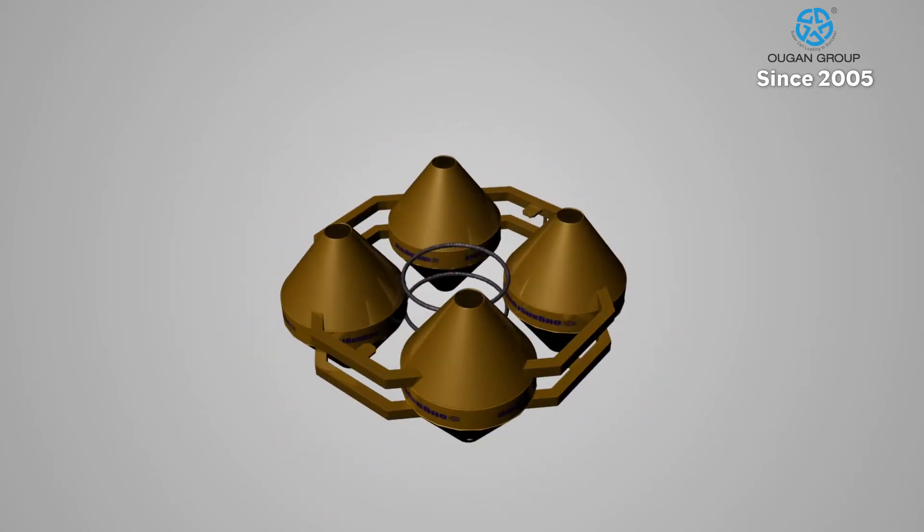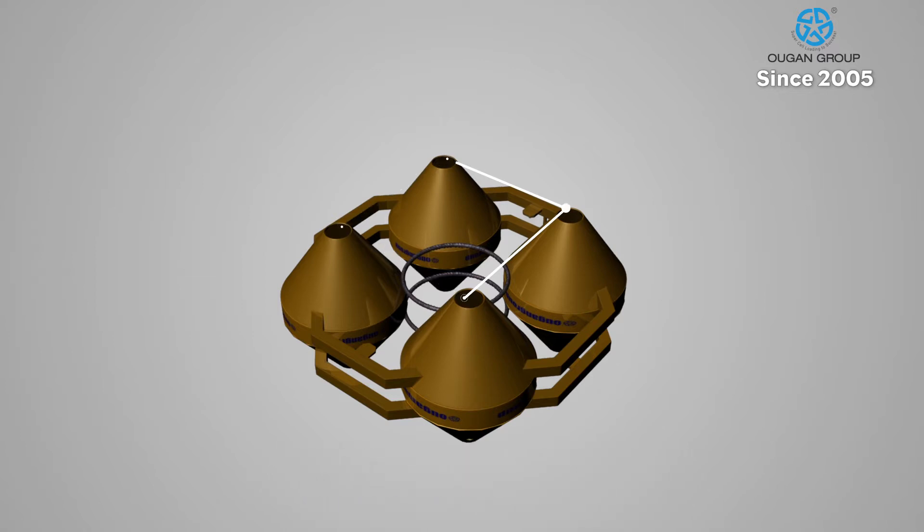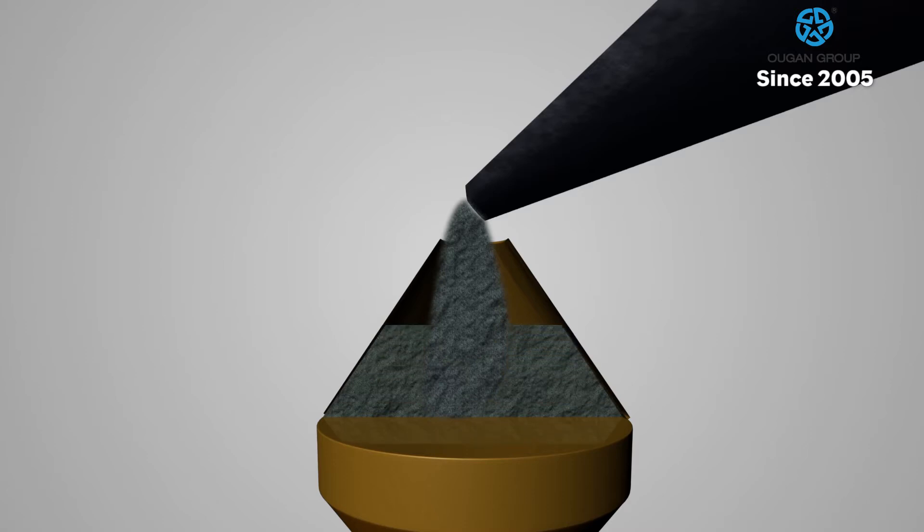To begin the utilization of the singular multiple-type supercell, the cavities are filled with concrete on both the top and bottom of the supercell. This is done to ensure the load from the jacks will be applied directly to the pile.